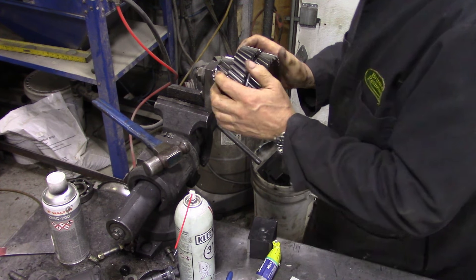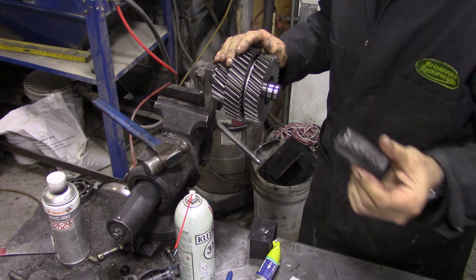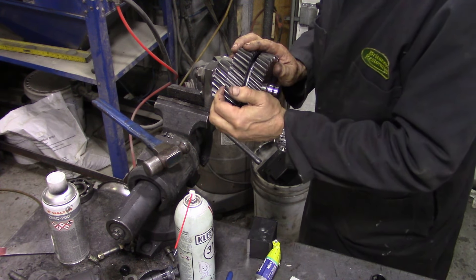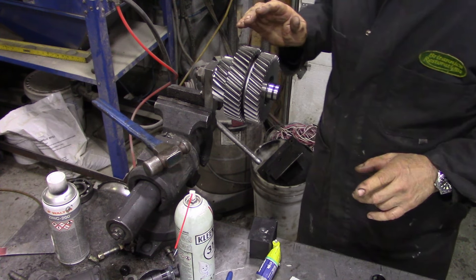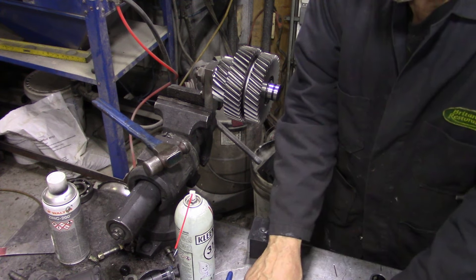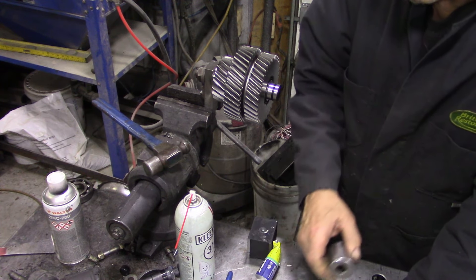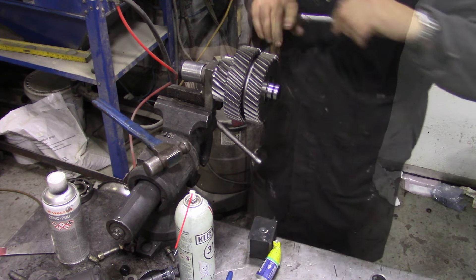Just a bit of play on that. Could we get away with this short one? It's supposed to be one newton meter of torque on that but I do it all by feel now. Let's take this off, swap over the tube and see if that short one will do the job - it might be too tight.